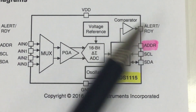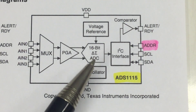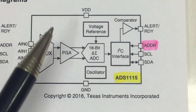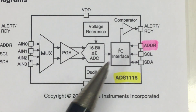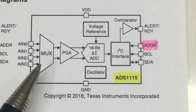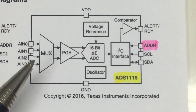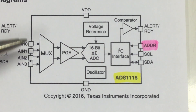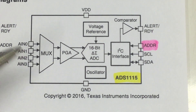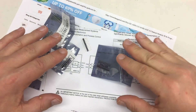These people are creative at Texas Instruments. You have a comparator and alert output, differential input, 16-bit sigma-delta analog-to-digital converter, programmable gain amplifier, and input multiplexer. The negative input of the differential PGA can also be connected to ground, giving you four single-ended inputs. Otherwise you can pair up two inputs each for two differential inputs - quite flexible, a nice little device.